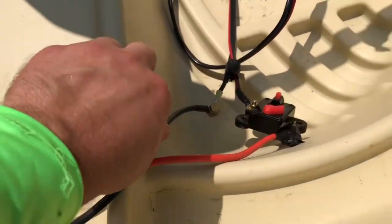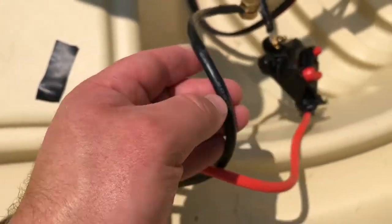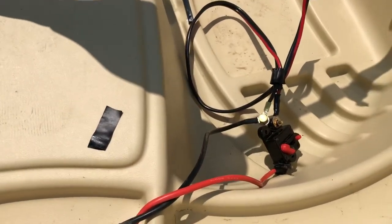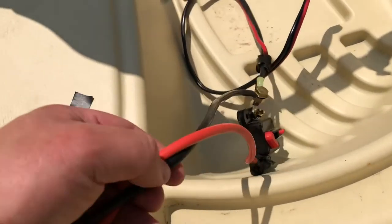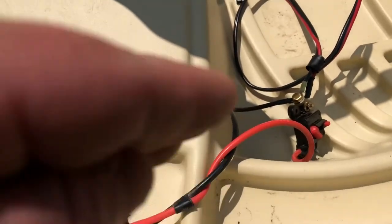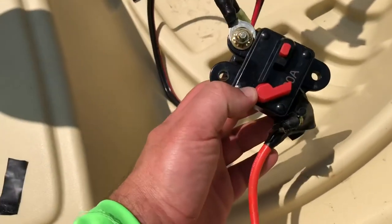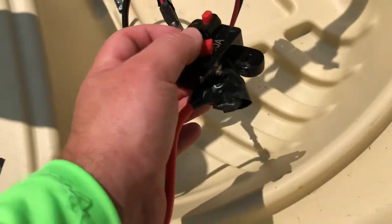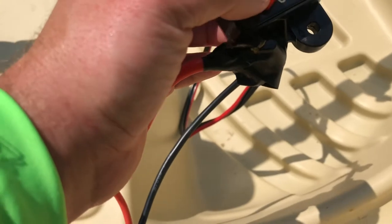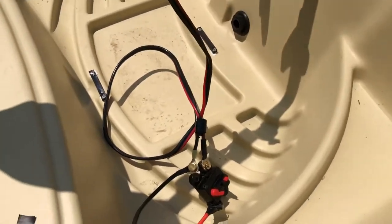The 10-foot section is an eight-gauge wire — you can see that stamped right on it. I know Minn Kota recommends running a six-gauge wire if you're going to go this far of a distance, but Newport Vessels made this for a reason — they made it for trolling motors. I trust them and I've had zero issues with any kind of overcurrent or overvoltage. That's kind of why you have the circuit breaker here to begin with. This is a 60-amp circuit breaker, which is what Minn Kota recommends on these trolling motors. If there's any amperage over 60 amps, it trips that breaker and protects your investment.